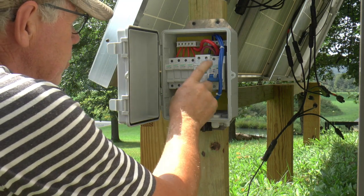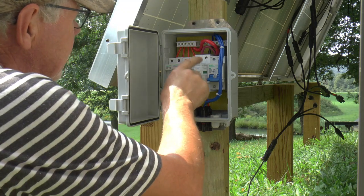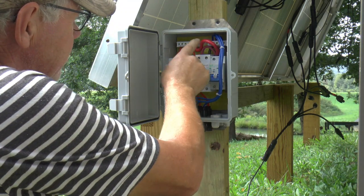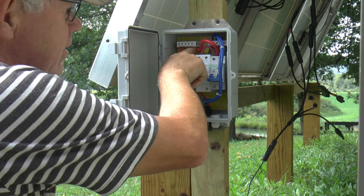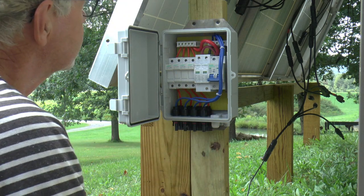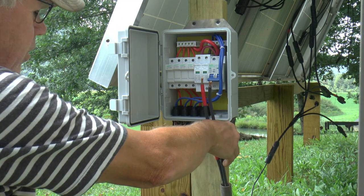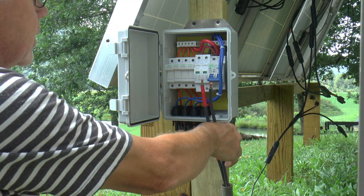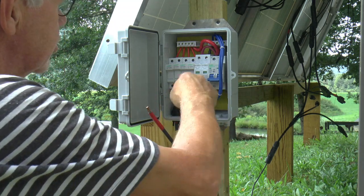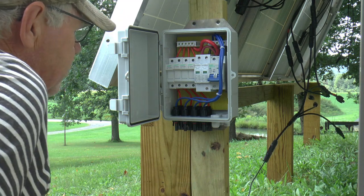Move the main breaker over here, put the surge protector there, and replace these wires with some heavier wires. They're not tinned now — I think that's number 6 too, same as what I've got going out of here. So should be all set to go. I got the length of the wires figured out. I usually like to leave a little extra in there, but this stuff is hard to work with in such a small space. We're going to go with it that way this time.